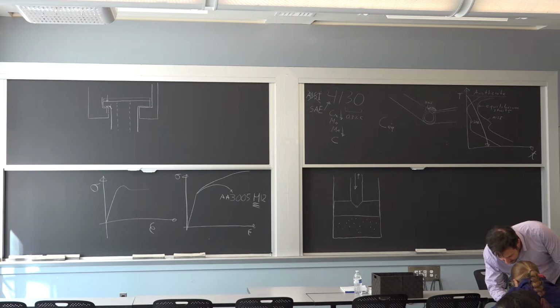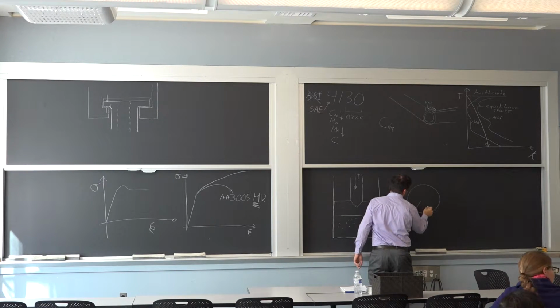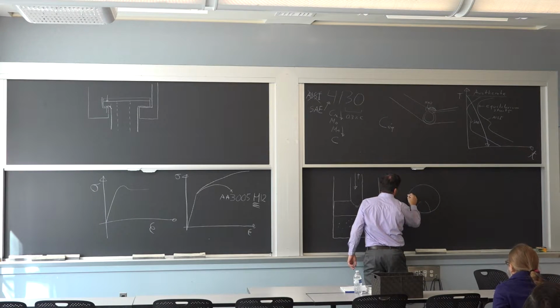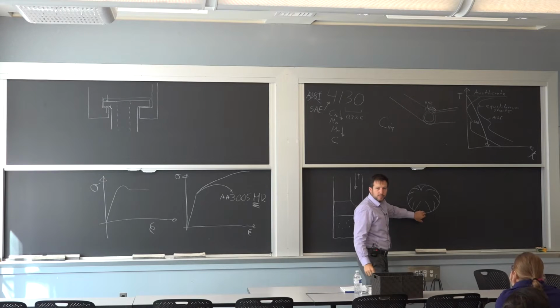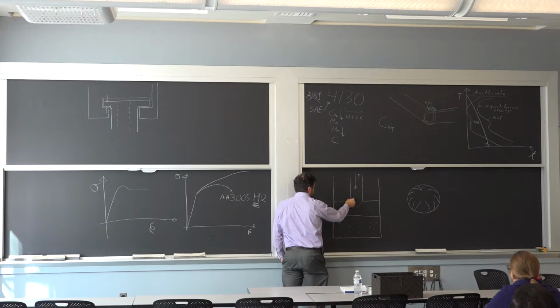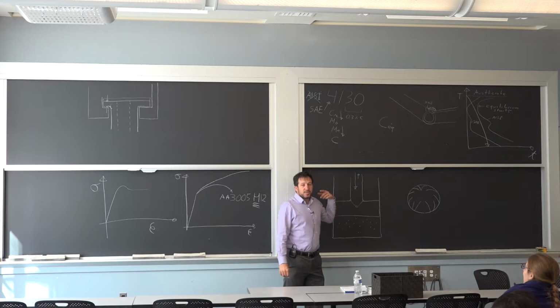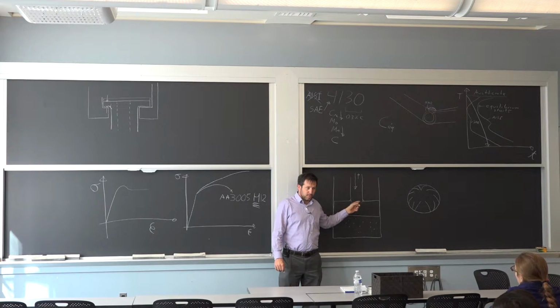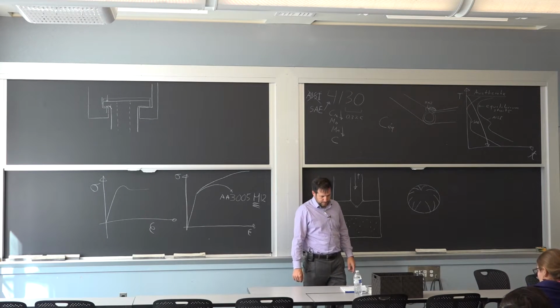And you see the biggest facet, this one right here, is the first initiation. And everything else started to go out in all directions. So from a top view, what you see on that fracture is the first initiation here. It's a bigger facet. And then everything else is going like this a little bit. It's curved. And then in the end, they really emerged like this. So this is where it started. Exact same problem as what we talked about. Why not put a nice radius here? It is an extra step in machining because you may need to use a different tool when you get to that part of the process. But that's how they could have easily avoided what happened in the friction condition.